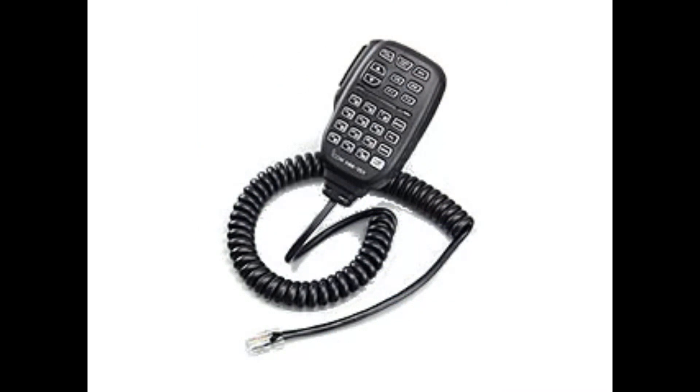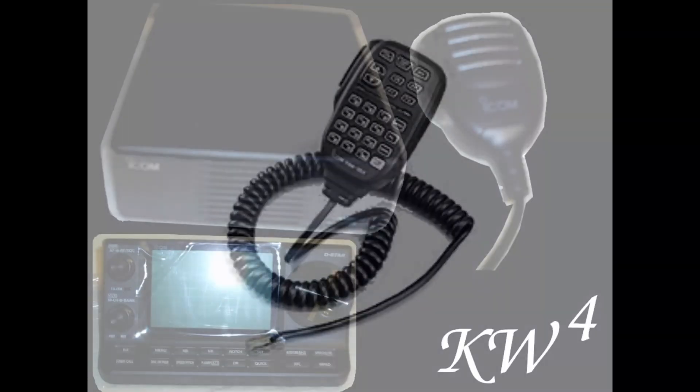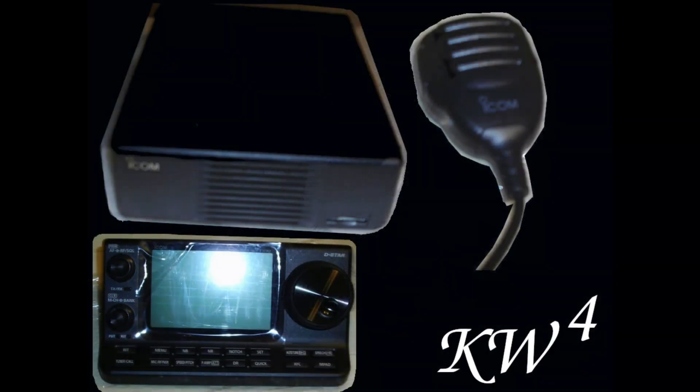The received sensitivity of this radio is very adjustable, and it does have a preamp that you can choose a couple of different power ratios to amplify. It has noise reduction circuits built-in. Digital sound processing makes a night and day difference in quality of incoming signal. The filters make it so you can hear an actual signal rather than just have a garbled transmission.